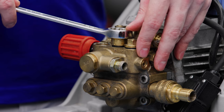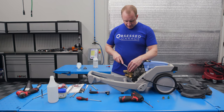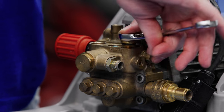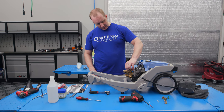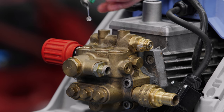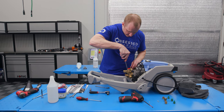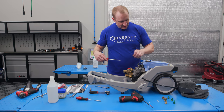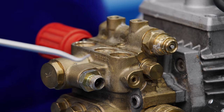It'd be really cool if you had a parts washer — you can throw the whole head of the pump in there and clean it out. There's an O-ring down at the bottom of this we're going to have to pull out. I think the two main maintenance items are going to be the check valves and the seal kit.